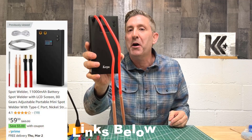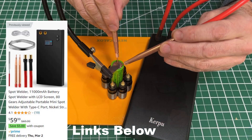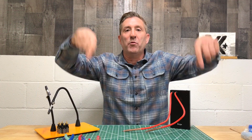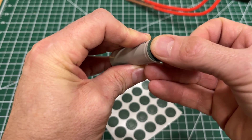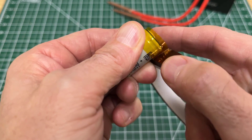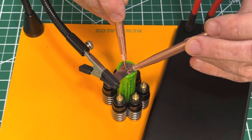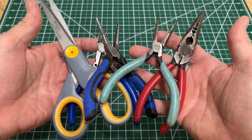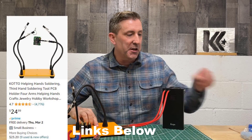Let's go over some of the equipment you're going to need to work with these cells. If you're ever going to put any effort into working with batteries, get yourself one of these — a battery spot welder. They're super cheap now and using it makes me giddy. I'll have a link to all this equipment down below. The other things you'll need: insulator tops for your batteries, some high temperature tape, nickel tabbing material to connect your batteries together, an assortment of small screwdrivers, needle nose pliers, cutters, and something called helping hands which lets you secure stuff while you work on it.